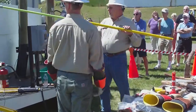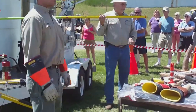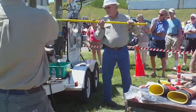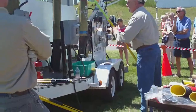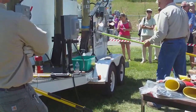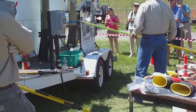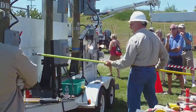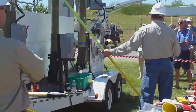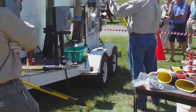We're taking power right now out of a breaker box over here supplied by the city of Sault Sainte Marie. We're back feeding 120 volts into the demonstration trailer, going up through this disconnect box. We've got a 120-240 source back feeding a transformer. A transformer does not care which way it's getting its power or putting it out.